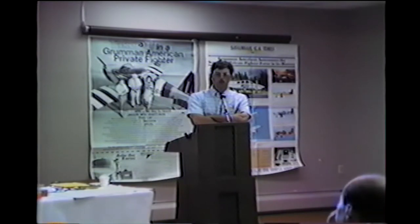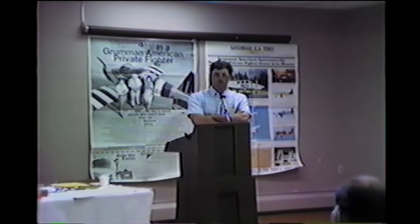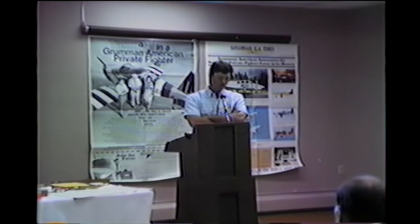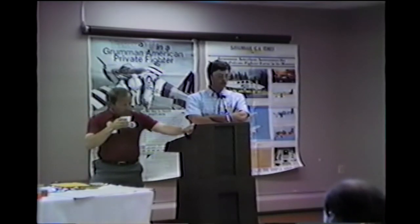That's right. What would you recommend for mags? Well, I recommend a Slick, the 4250, 4251, or go ahead and go with the newer Slick mags. Some people in cold country like more spark. They say the Bendix puts out a little more spark than the Slicks. I don't really know that, since the 4200 has a slightly larger coil in it than the older 4000 series. We've really had more problems with the 4200 series mags than the old 4000 series. But at least they are rebuildable, and when the points wear out, you can change them, and there's no problem if you don't change the whole mag.